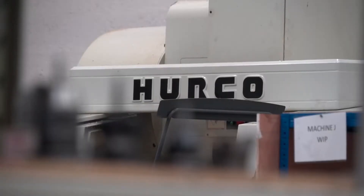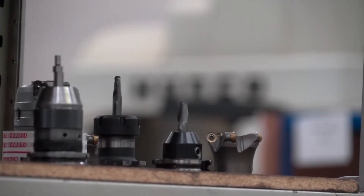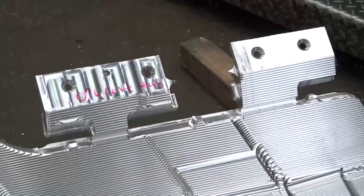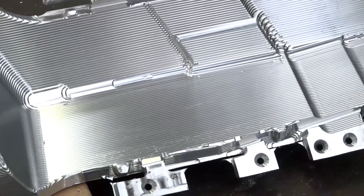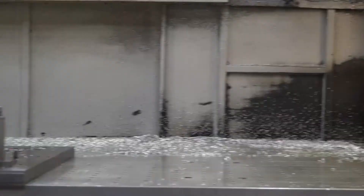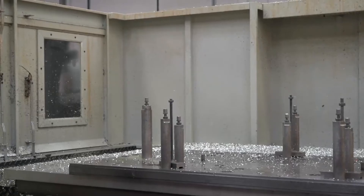How are they seen by your business compared to the other machines you've got? Well, we do a lot of small batch work, so to be able to program conversationally or NC — it'll take either, doesn't really matter. But to program conversationally or make any toolpath, which we do a lot of, they are the perfect machine for it because it's so easy — you can knock up a program to do some blocking up or put some holes in literally in five minutes, whereas NC might take a bit longer and then you've got to post it down.